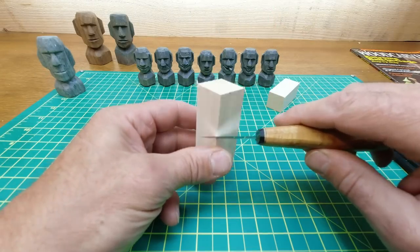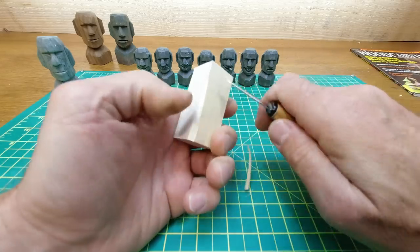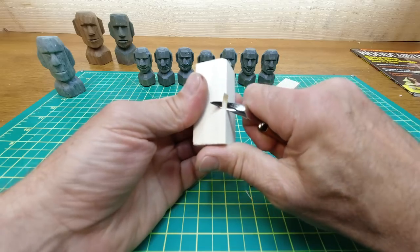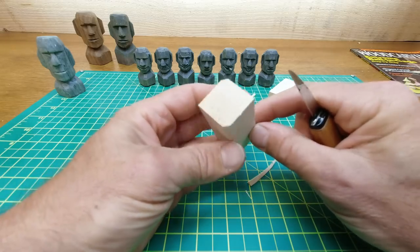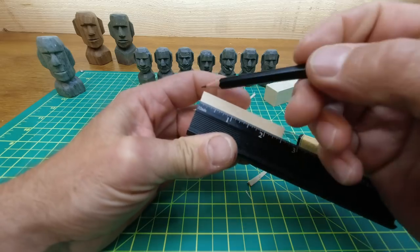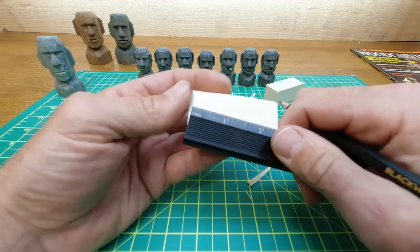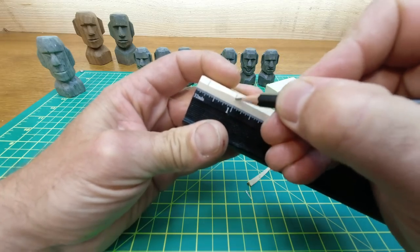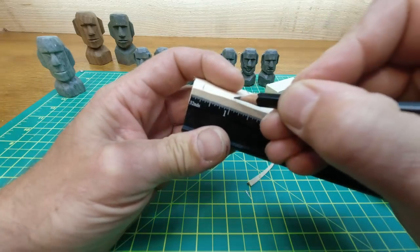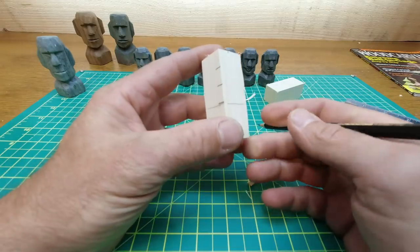We're going to do the face on the point this time. Let's start with the sides here before we put a measurement down. I'm going to take my knife and just peel off a healthy eighth of an inch flat on both sides. Now I'm going to mark from the top — going half inch, one inch, one and a half inch. Then on the sides where the ears are going to be, we're going to come down a quarter inch, one inch, leaving a three-quarter inch ear. Quarter inch, one inch. Now I'm going to take that bottom line and bring it around on both sides — but that's all our marks.